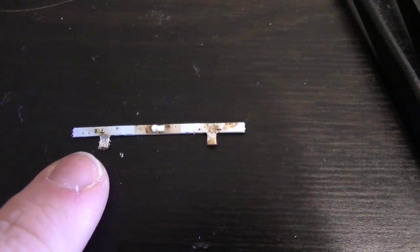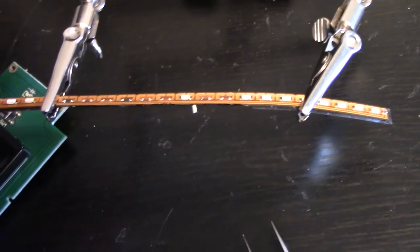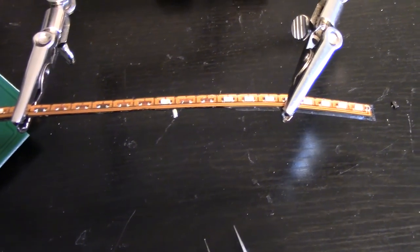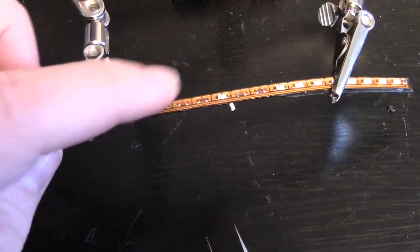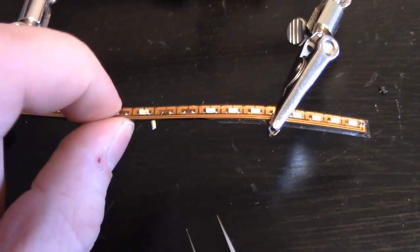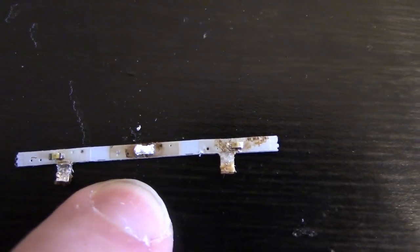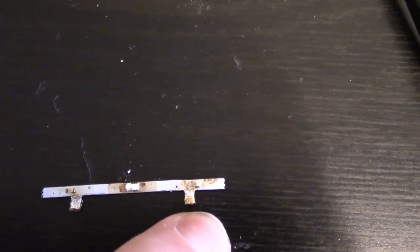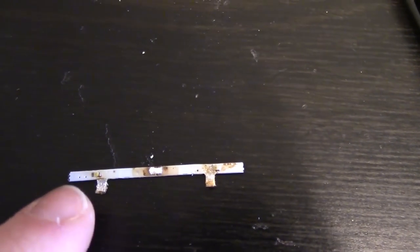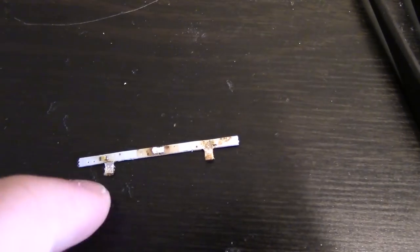This LED here is the working one; the other two LEDs have failed. What I did was take a backlight from another display — this is from an old automotive display. I have a whole bunch of these from a project a long time ago that I have no use for anymore. I took out the LED strip and desoldered a couple of them, so I just have a little pile of them. These are white LEDs, which is what this originally had. However, these are right-angle and they're a slightly larger pin pitch. So I've retrofitted the center one here — it's actually firing down towards the diffuser on the back. It does work, and it's got the same forward voltage as the original LED. I'm going to do the other one and then put this back in there. The color temperature is slightly off — this one's slightly cooler than the one I'm putting in — but no one is ever going to notice or care.